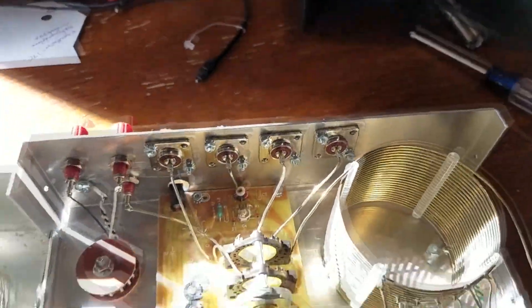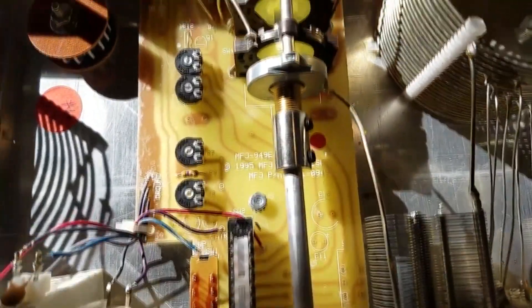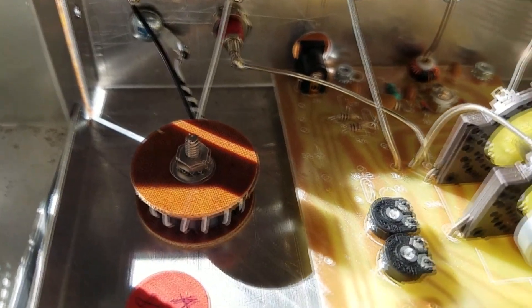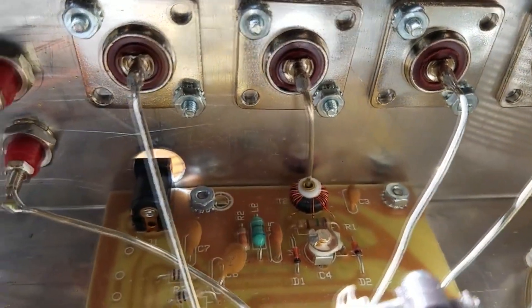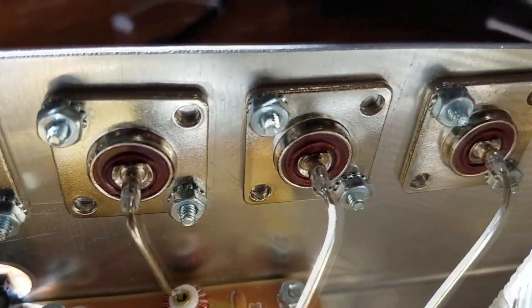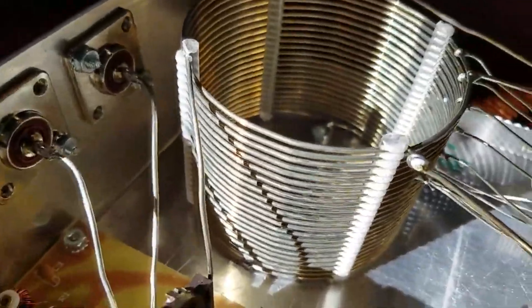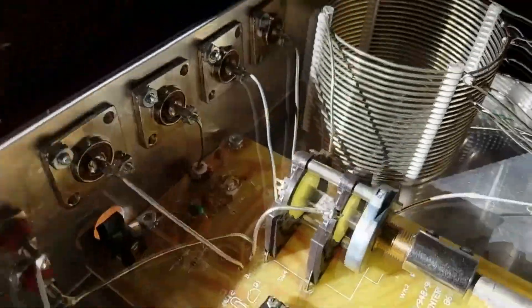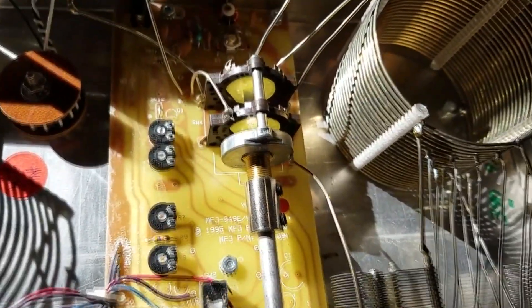Going to the 941E — in some ways they've cheapened it, in some ways they've improved it. I think the board may be an improvement, but the balun is still pretty much a cheesy balun. I do like that they put screws with star washers to mount the SO-239s — that's an improvement over the old one that's riveted in. The coil seems to be about the same. The board is marked 1995, however I bought this at the end of 2019 and it was actually produced in August of 2019.